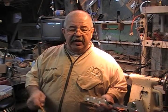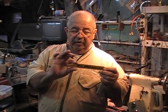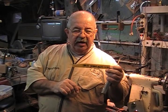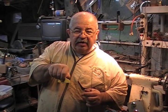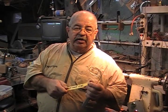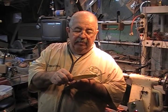But let's jump over that, all right? Let's go to DeWalt and get a fire and rescue blade. It's a little bit wider, got a better hook on it, and doesn't take as much reshaping. Now what you have to do is take it over to your belt sander and take the teeth off. And don't go right down the center of it. Put it off on the edge a little bit. Or take your offset grinder, put it in a vise and knock the teeth off. But you're going to eventually want to get it nice and flat on the bottom.